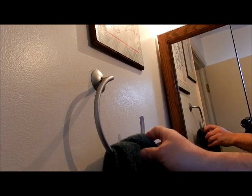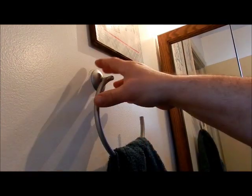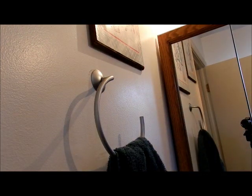Hopefully this video helped you out. You can have any kind of towel holder and this approach will help you out. If you have a towel rack that gets pulled on all the time and keeps coming out of the wall — find a stud. Those little plastic drywall anchors don't work worth a darn. And if you're building a room, think ahead — beams go 16 inches center to center, and you can put a 2x4 going straight across where a towel rack would go and screw right into that. Subscribe and see more things coming up!